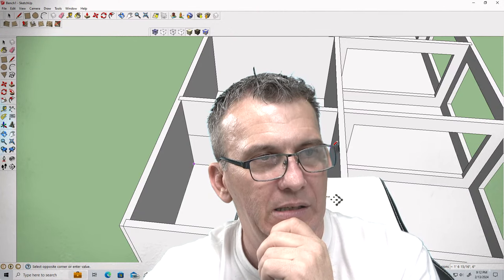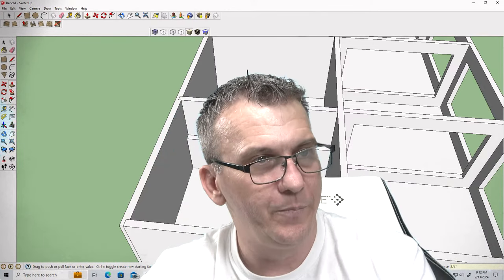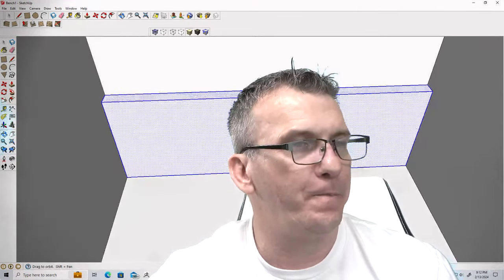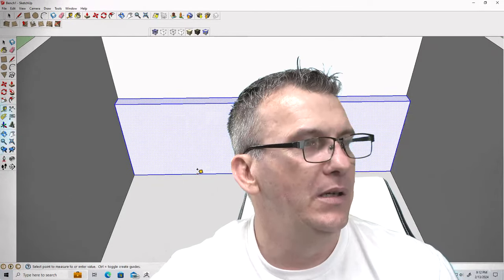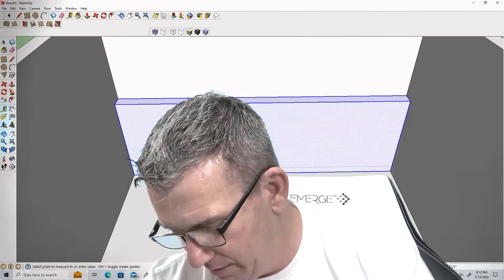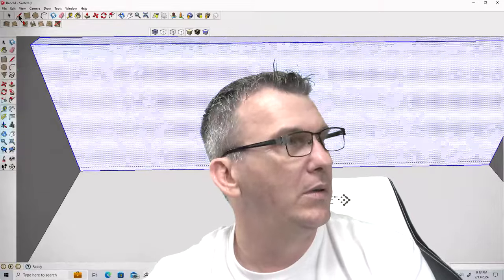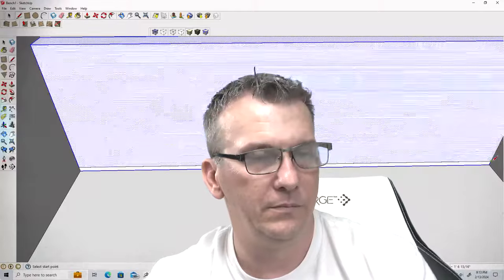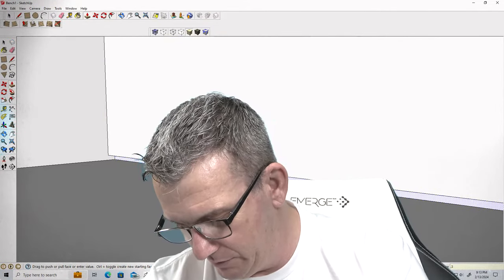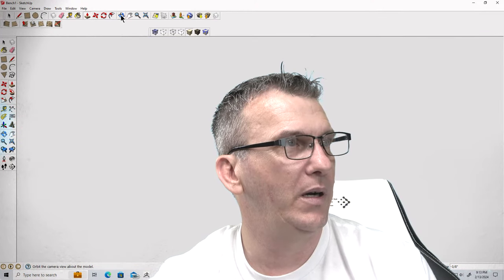It is, if I push pull that, 0.75. Take the tape measure, come up 1/4 inch, which is 7/32 in plywood, so 7/32. Draw a line there. Push pull that back 3/8, 0.375. Okay, oop, I lost my part. Hold on a minute.